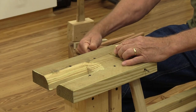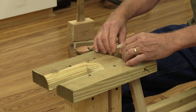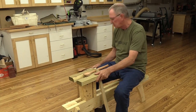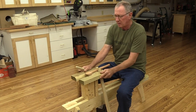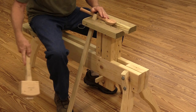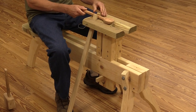Once the wire's in place, the jaws are set so that they are basically fixed, but there's enough flexibility in the wire that they will twist and move a little bit. One of the design features of the head on the horse is this wedge. You can see the head will move so that you can adjust the work distance. But once you find where you want it, you can secure it with a wedge, tap it in place, and then you have a nice solid work platform.